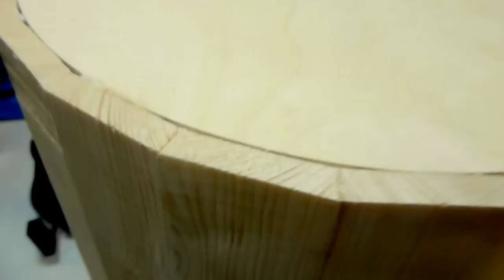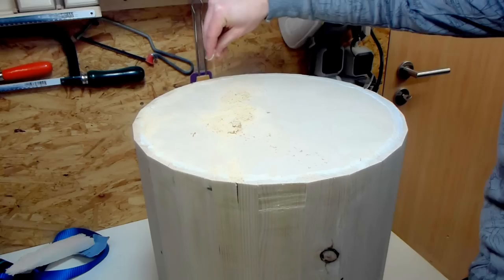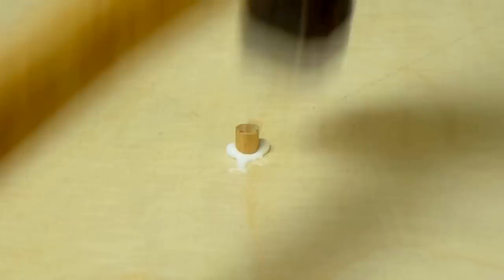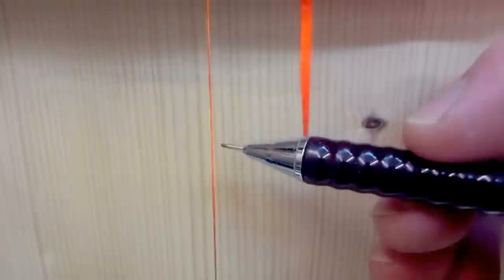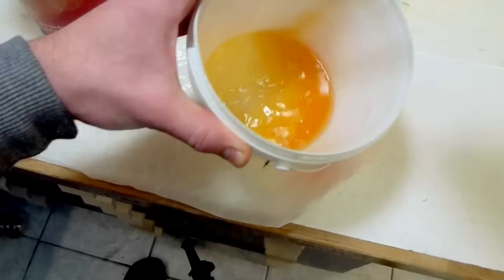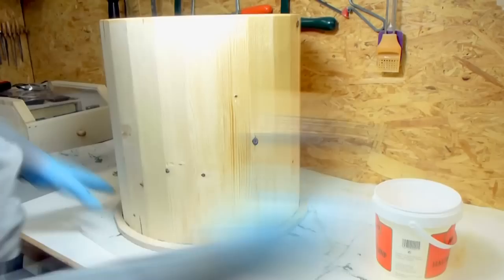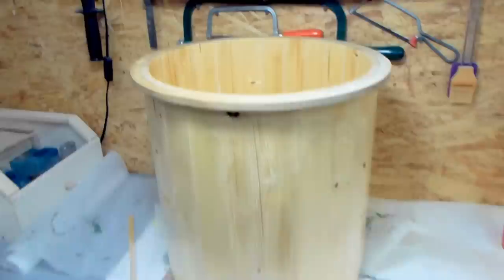Because the bucket wall is segmented and the bottom is perfectly round, I ended up with a lot of gaps around there, and I need to fill them because the whole bucket needs to be airtight. I did this by filling them with a mixture of bandsaw dust and glue. Then I put a light inside the bucket and looked for light gaps — and found quite a few. I marked them so I knew where to fill more. Once that was done and everything was sanded smooth I put on an oil-based varnish, thinned a little. Hopefully this varnish will seal even the smallest gaps in the wood and prevent warpage so new gaps won't develop over time.